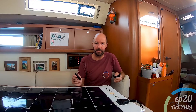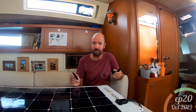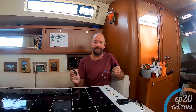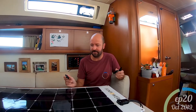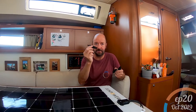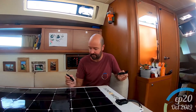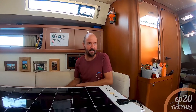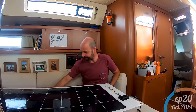What can happen when a shadow falls on a solar panel is that it drastically reduces the power output of that panel. If your panels are connected in series or parallel, that one shadow can affect the entire power output of the whole system. So we've got these extra little bits called diodes — you connect these between the positives of the solar panels, and if a shadow falls on one panel it does not affect the power output of the other two. You get a lot more power from the system with these diodes.